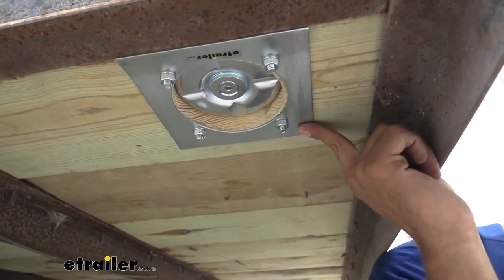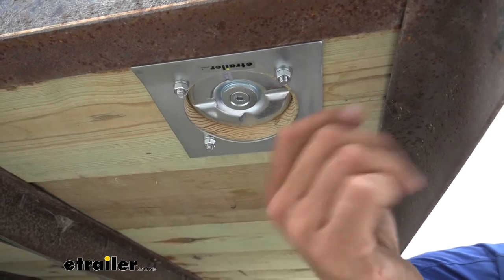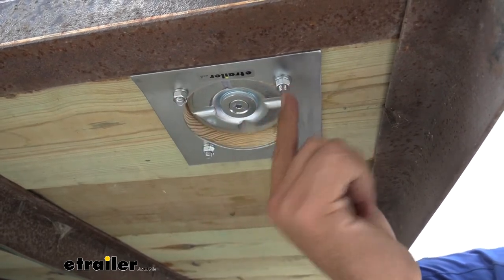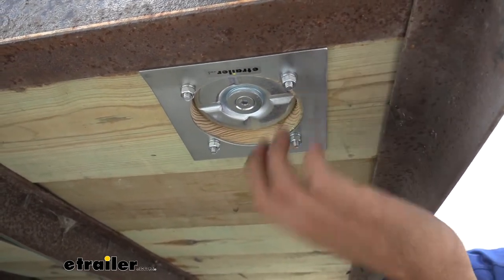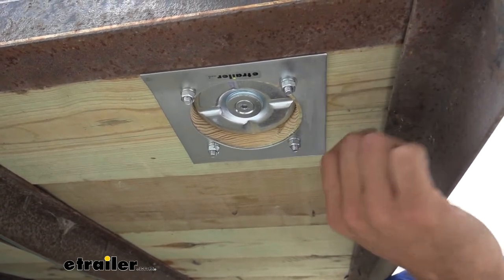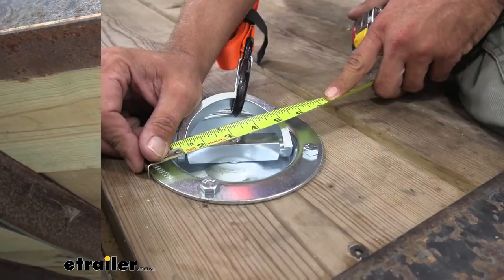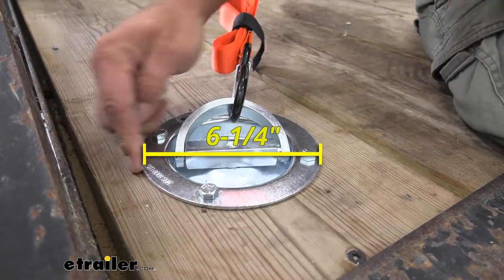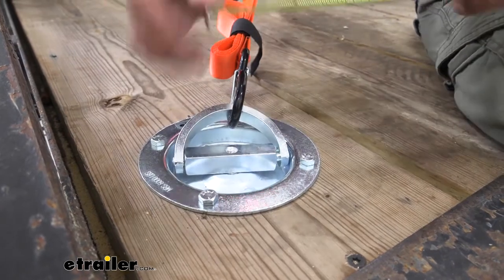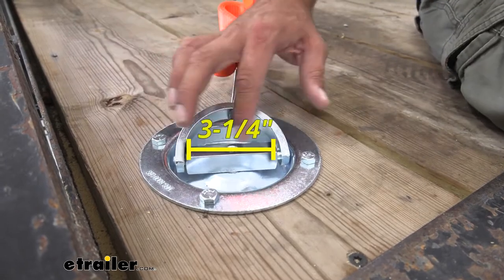Here's that backing plate and what it's going to look like. As you can see, it's got a nice large width to it. This helps to spread the energy out over a greater area. You can see the bolts pass all the way through, which just provides a lot of support on that bottom side. For most wood applications, or any weaker material for that matter, I definitely recommend getting that so you can get it nice and secure. Overall, we're looking at about six and a quarter inches total diameter. The usable portion inside to inside on the D-ring is going to be about three and a quarter at its widest.